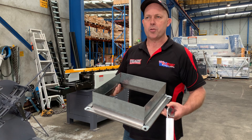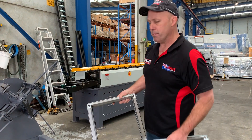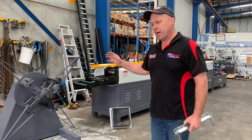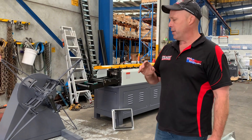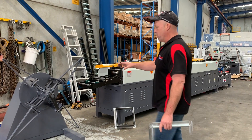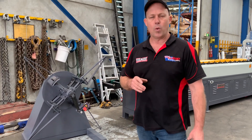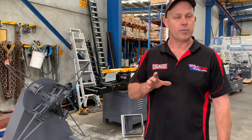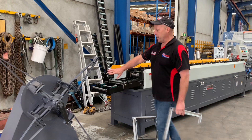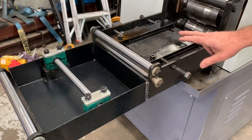The Australian HVAC industry generally uses TDF and TDC, and this is a TDC profile here. Now, what our machine comprises of: we've got about a two-tonne expanding mandrel manual decoiler with manual expansion to the front and a manual drag system. You order from your local steel supplier a slit coil of 143mm wide by 1mm galvanised steel — that's your blank size for this machine. So we've got our expanding manual decoiler and your infeed guides, pencil there, 143 by 1mm.